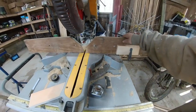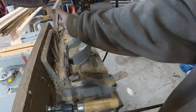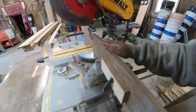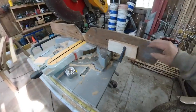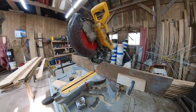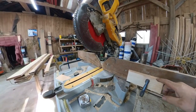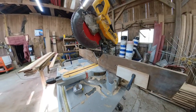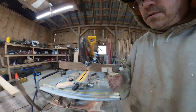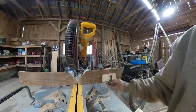The tip I have here for you: this is my cutoff saw or miter saw, and it normally just comes with an aluminum fence. I bolted a piece of three-quarter inch plywood on that and extended it. That way, whenever I'm cutting boards — I need twenty-four six-by-ten inch pieces for the compartments — I just set a block on there at ten inches and I don't have to measure every piece. Every piece is going to be the exact same size, because even being off a sixteenth of an inch can mess with your plans.